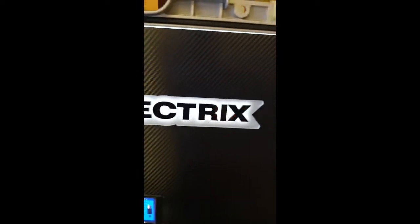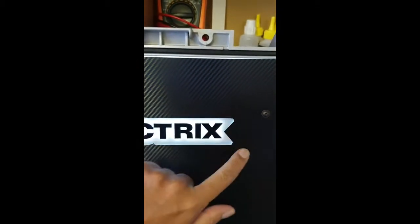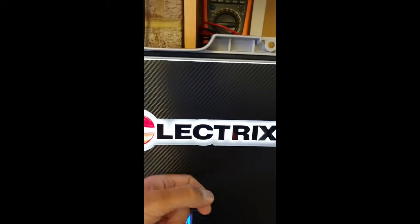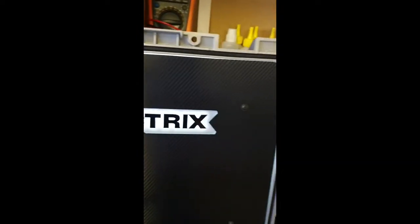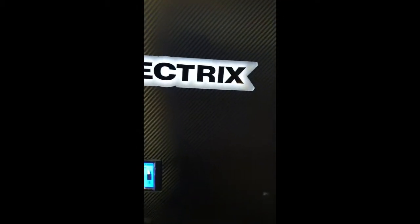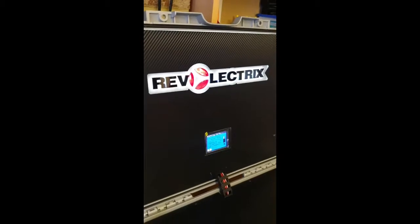So again, the photographs at the end will show that this deck plate is recessed. The actual logo itself is a rectangular shape in there, and there are six small self-tapping screws securing it in place to the back of the 10mm thick polypropylene main deck. Then behind it, it's all open, so that's creating light and throwing it all around, which is quite good. And where there's the very minute gap around, you do get a little light bleed from the outside, which has a quite nice effect as well, a halo sort of effect. But that logo looks good. I'm really pleased with that.